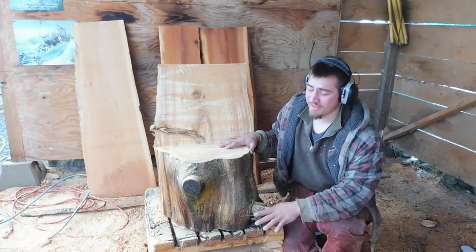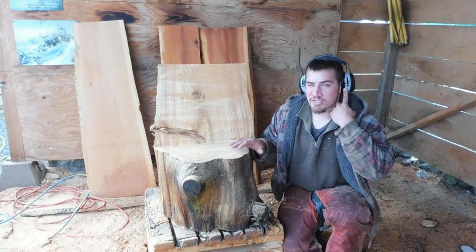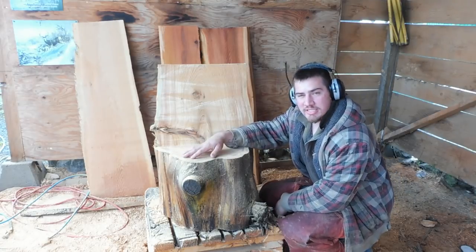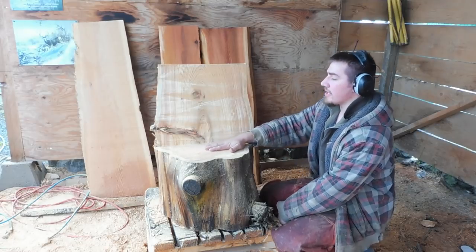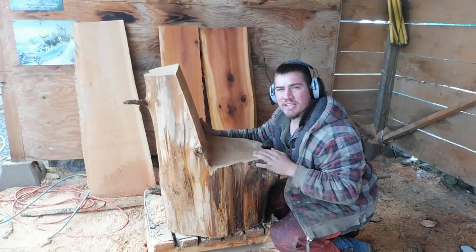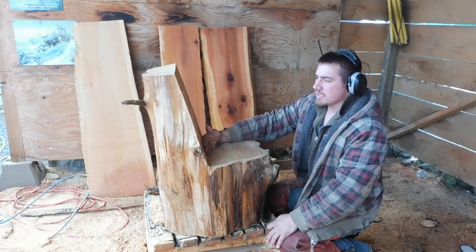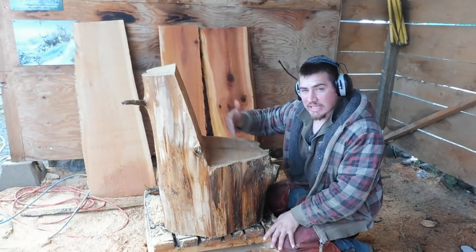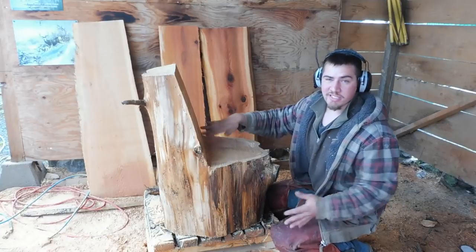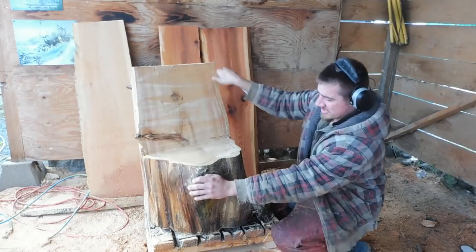So I made a little boo-boo — I accidentally cut it an inch too short — but it's not rocket science, it's a bench, so it's not the end of the world. My seat height is 14, and when I put the slab on it'll be 16 because it's two inches thick. About the back — there's a slight angle coming in from the back down. Optimal is apparently a four-inch lean, and from the seat you want to slope inwards down an inch. I just do it flat because I don't sit on them, and I haven't got any complaints so far.